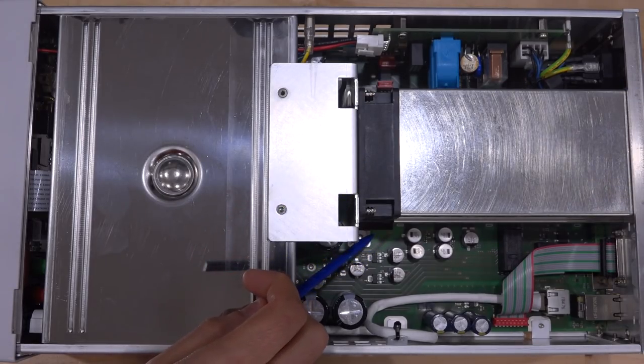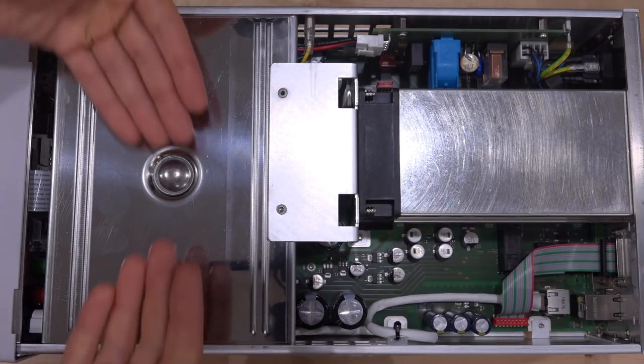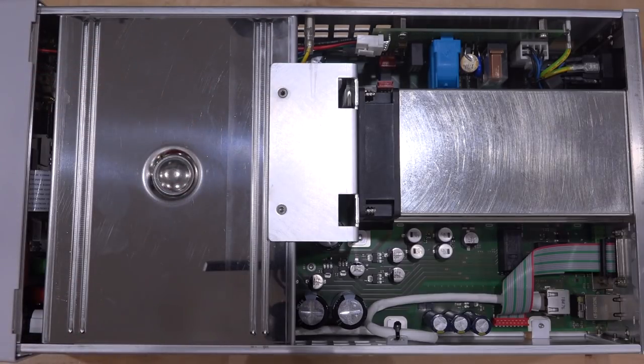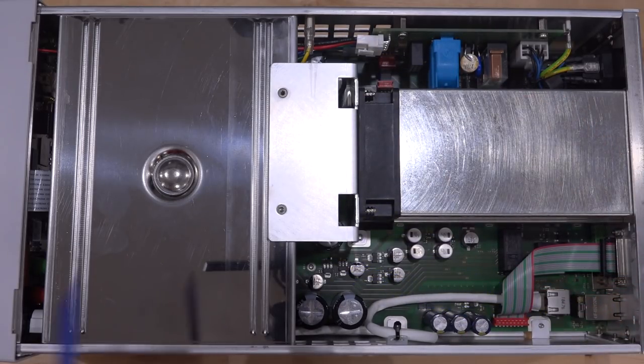This big fan is responsible for the whole airflow and even sticks through the PCB at the bottom, keeping the instrument height under control. Air comes from the sides and goes through, and all the power devices are mounted to a heat sink underneath. On the top there's an extra PCB vertically mounted where the power comes in, voltage selection is done, filtering and conditioning before it goes to the main transformer underneath. There are also big passives and capacitors under the main PCB.